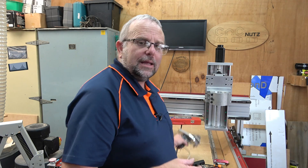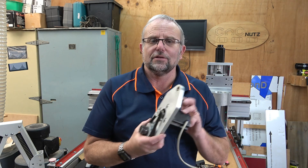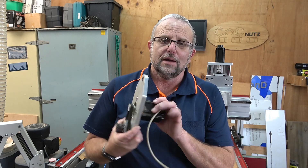Okay, that's looking good - that's as close as I can get it at this time to being square and parallel to the table surface. There's a good chance I'm going to have to revisit this - I'm crossing my fingers I don't, but only time will tell. I'm going to need to resurface this table to get it perfectly parallel, and then recheck for square once I've done that. But I can't do that until I have the machine running.